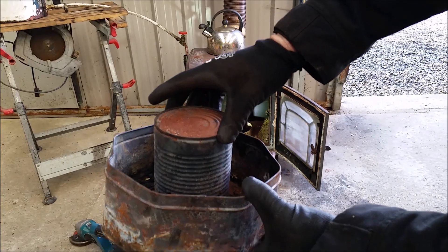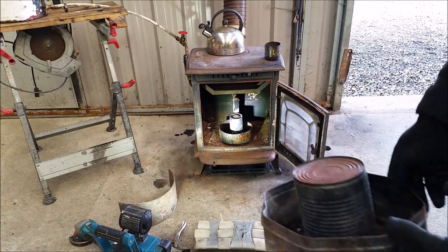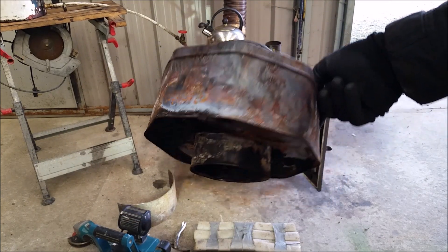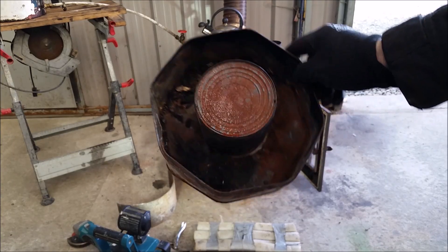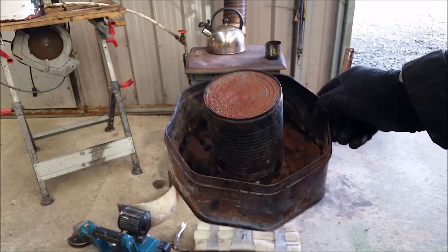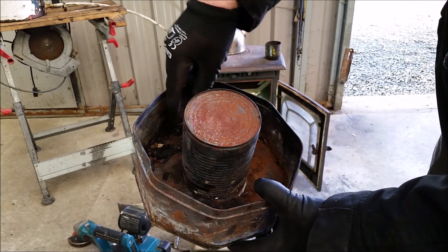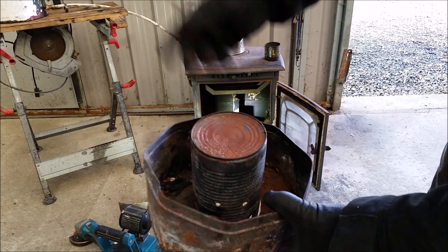I tried this in a different stove and it worked great, so I thought I'd give it a shot and made one out of heavier materials. The prototype was a one-time-use item, but if you want to experiment you could bang one of these up in a few minutes — literally a biscuit tin, a dog food tin, a hammer and a drill. In the first setup I put some wood shavings and waste oil into the compartment, closed the door on the stove, and off it went — it burnt really, really well.